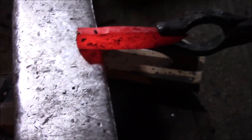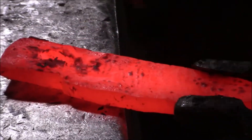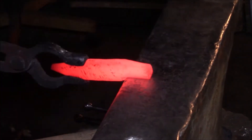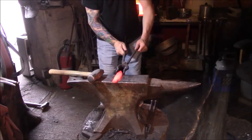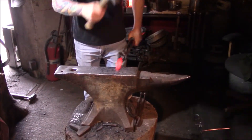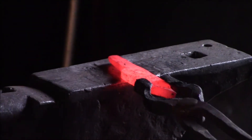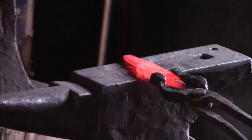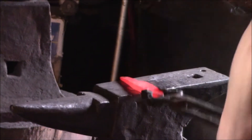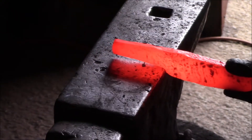I'll draw the tang in length — draw that down a little smaller. The thinner I can get it, the better bite I can get on it with these tongs. I'm not having a hard time hanging on to it. Working on the tang outside.